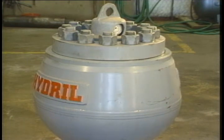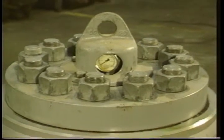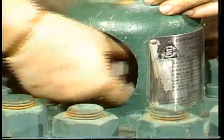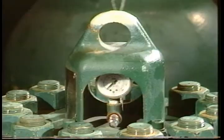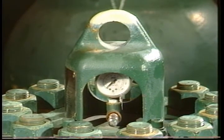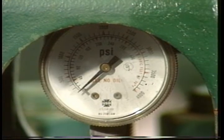If you suspect a leak, there's a couple of things you need to do. First, turn the mud pump off and check the pressure gauge. You can read the Hydral gauge right away, but we'll have to open the valve handle on the Continental unit. Do this with the mud pump off and open the valve slowly. Stand back from the gauge a little bit. The glass has been known to blow out when pressure hits the gauge. If the pressure is low or non-existent, there's a leak.